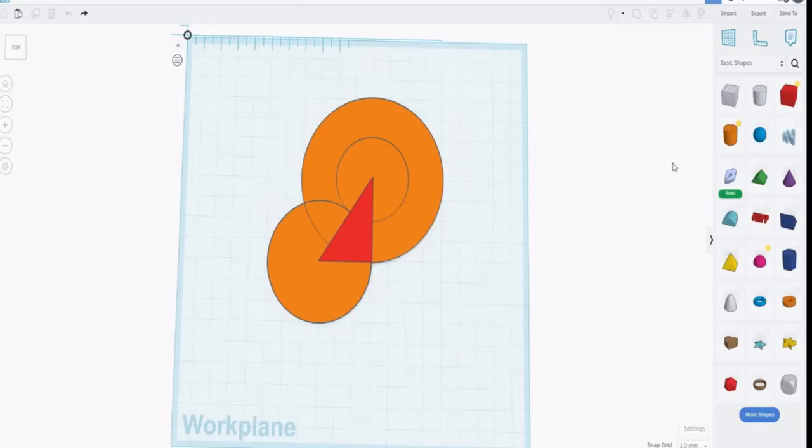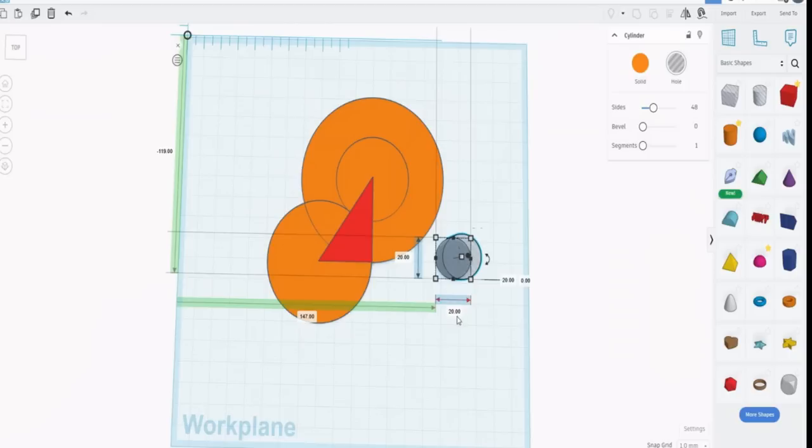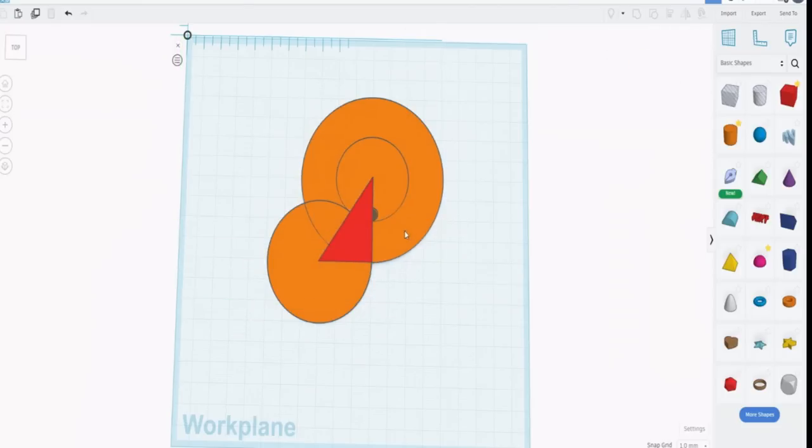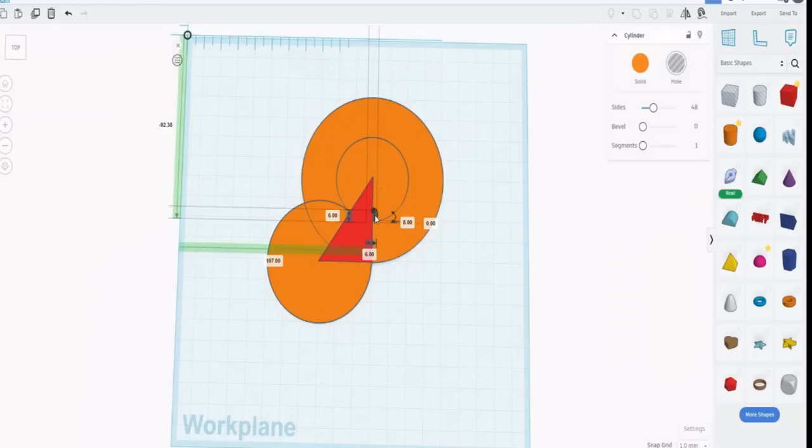Now what we need to do is create the slot, and we create the slot using a cylinder primitive. Now I'm going to choose 6mm as my slot size because it's just a choice that I think is reasonable. And I'm going to make that 8mm high so I can grab it, but it's still in place. We need that first hole to be right there where the triangle intersects with the circle. But in this orientation, we know that's perpendicular, and we know it's perpendicular to this. So we can take the hole and the inner circle, and we can align them by pressing the Align key, and we align them to the center and this edge here. Now the edge is actually on the inside of the circle, and we need it to be directly on the circle center to center. It's 6, so use the arrow key to move that down 3.